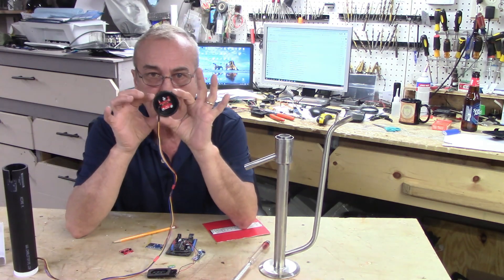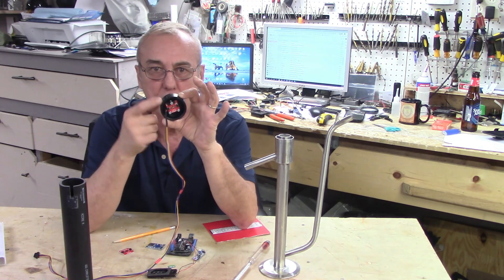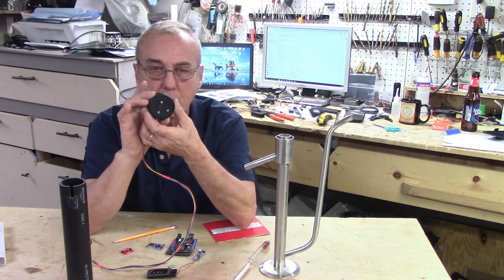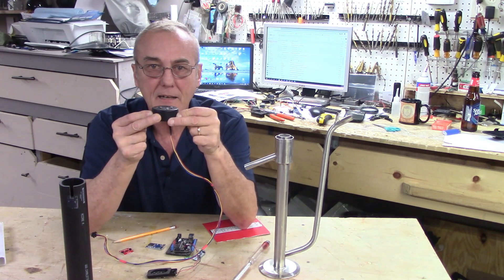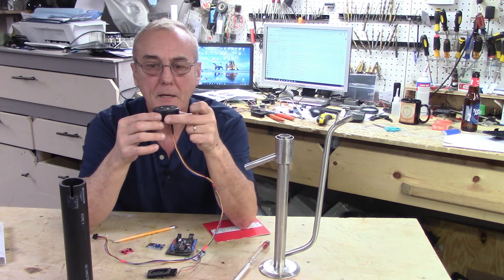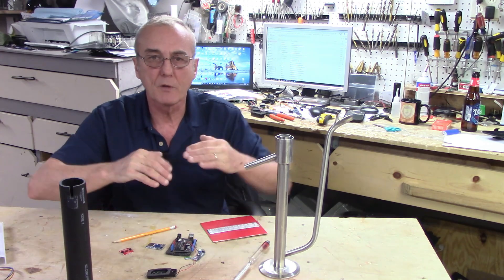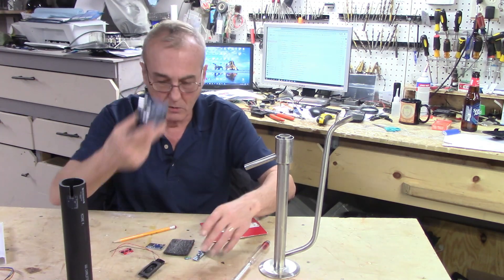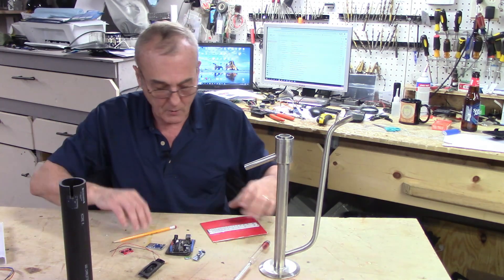I fashioned the time-of-flight sensor inside a black cap that goes on top of the parrot head. I've got three screws with springs behind them, which allows me to turn those screws and adjust the time-of-flight sensor ever so slightly — left, right — until I can fine-tune it to shoot straight down. That was one of the adaptations we found really necessary to fine-tune the equipment. I also built three of these in a row using different boards — the Uno, the Nano, the Mega — just to make sure the results were repeatable, and it worked out perfectly.